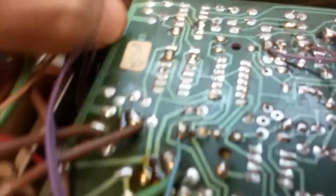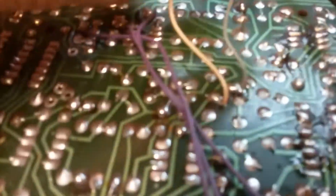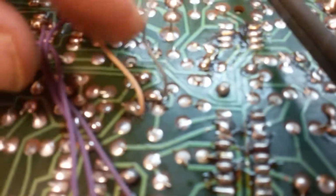But I wanted to document where these wires go. This white wire here comes all the way over to here, and that goes to the power switch here, the bypass pedal switch. And then we've got 2 wires that wrap around here, a white wire and a gray wire, and they go right there where you see them on those bad solder joints, but they're okay.